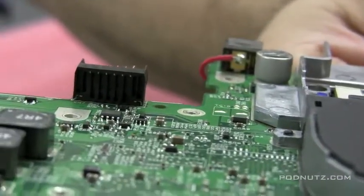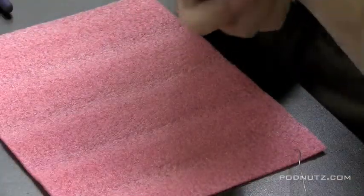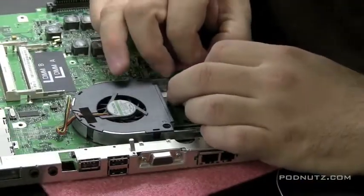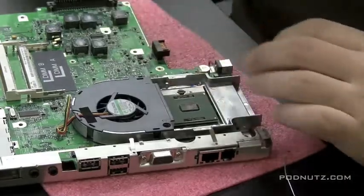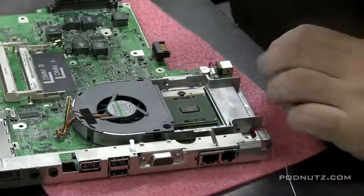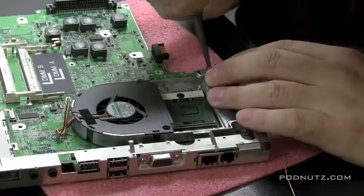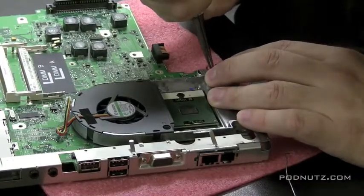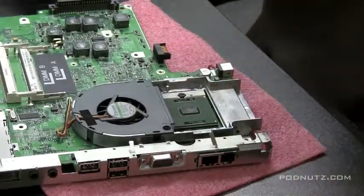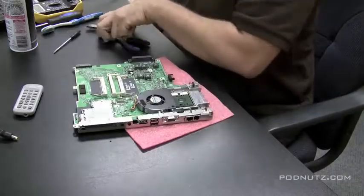Now that it's connected, I tested it with the pliers to make sure it's a strong connection. The soldering is essentially done — give it a little tug to make sure it's secure. Basically what we're doing here is bypassing the pin for the power jack with a wire, which is better due to the flexibility.